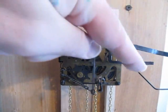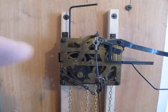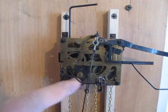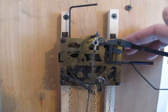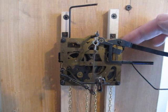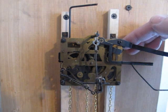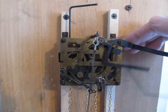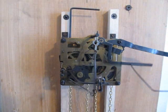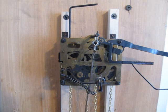Let's take a quick look at the mechanism — we're just about done here. See the different functions: the top there is the cuckoo, that's the little gong, those are the two bellows, and over there on the right was the chimes. So in one quarter speed now: the chimes go, the cuckoo at the top, the gong, and then the two bellows, and the cuckoo comes back in the house.